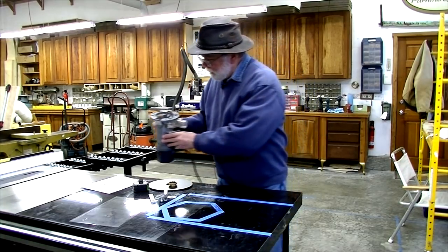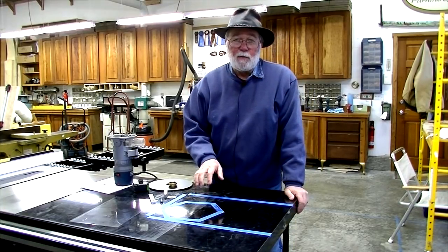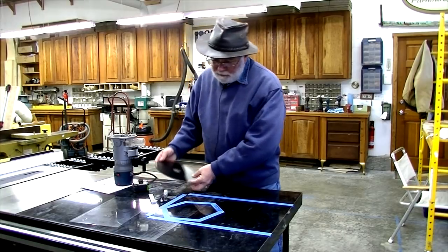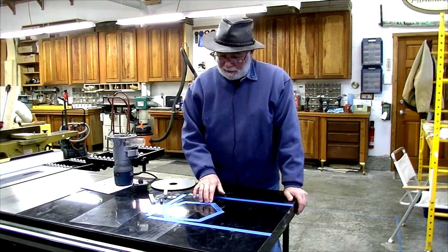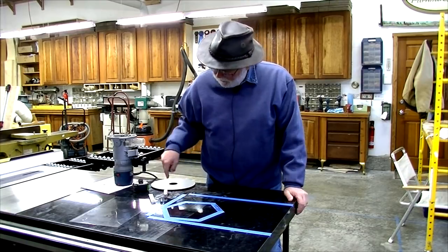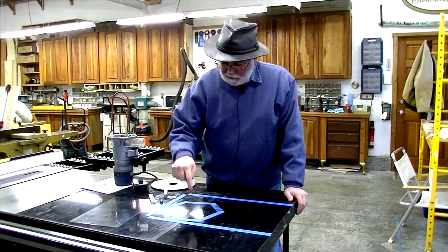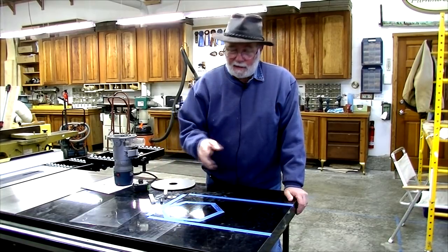The other thing I've thought about is that this table has a plastic coating on it that I don't want to chip. So I put tape around the outline of where this hole is going to be cut so that I'll have less chance of chip out. That also gave me the opportunity to draw the line where this would be so that I make sure I don't get into the area where the actual underneath supports are. And so I should be able to just drill my first pilot hole right in the very center and align everything to that and do my cuts.